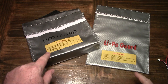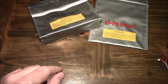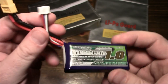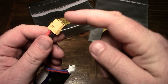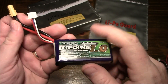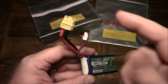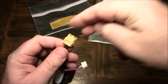One thing you can do to prevent batteries from exploding and reduce your risk dramatically is to use a balanced charger. When charging a three-cell battery, if you only use the main charge port, you're just forcing juice into all three cells and trying to raise the voltage up to 12.6 volts. Once it reads 12.6 volts it'll quit charging, but that's not balanced charging — you're basically just shoving juice in and all three cells are accepting it.